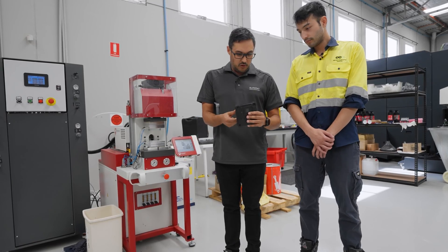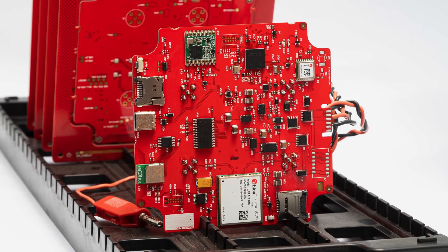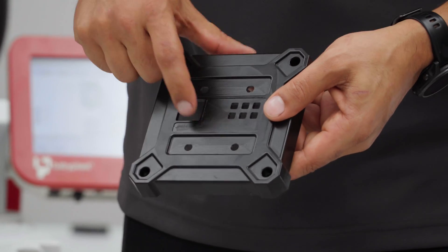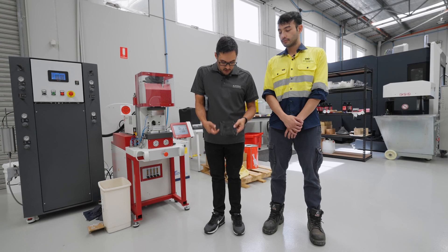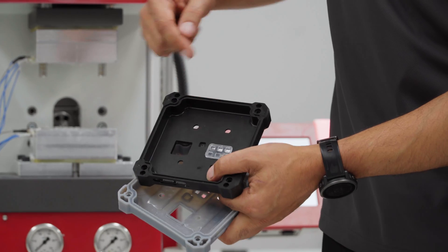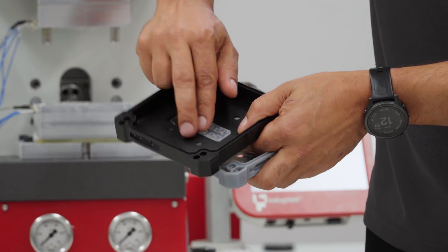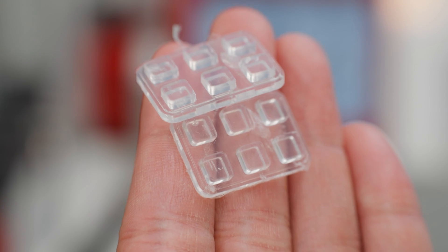This is the top hat — we call it — the control and compute module for the Cranio Pro. It has a number of different connections to the internet: Bluetooth, Wi-Fi, cellular, GPS, and long-range RF. It's got RGB LEDs and a button for input so someone can push the button to turn the whole Cranio stack on and use the RGB LEDs for feedback. We're also going to have a button for a user interface and another seal for a barometric or air quality sensor. So these seals are really important so we can create a rugged connection.